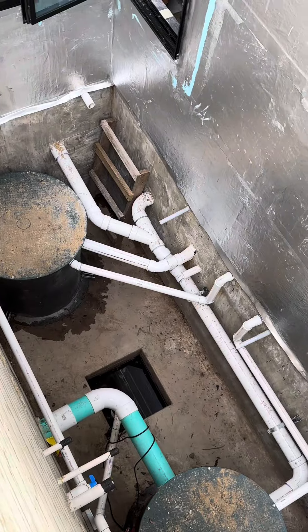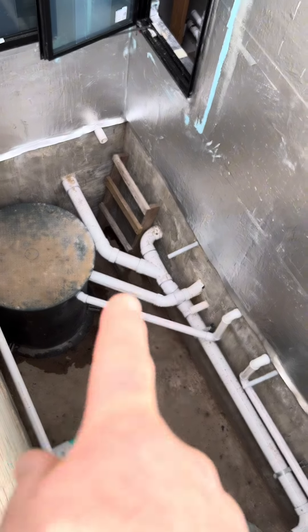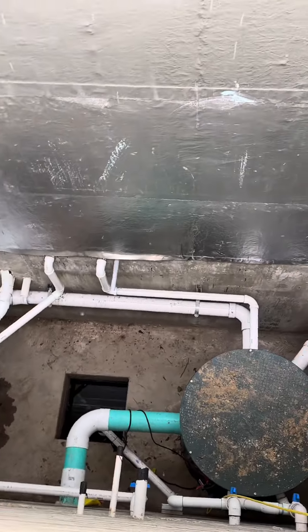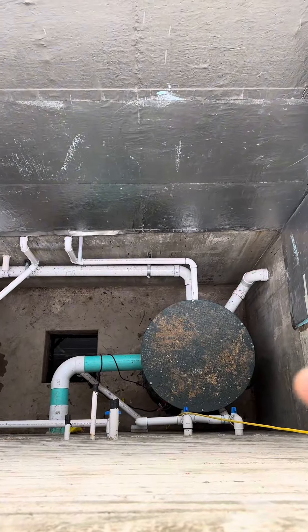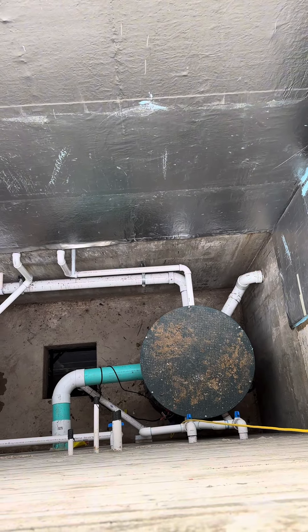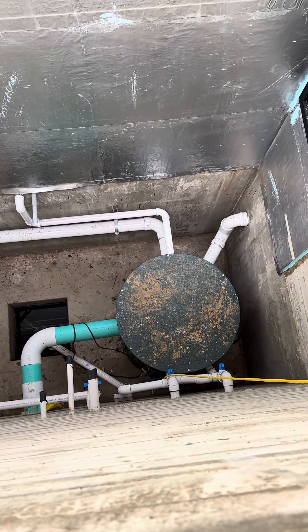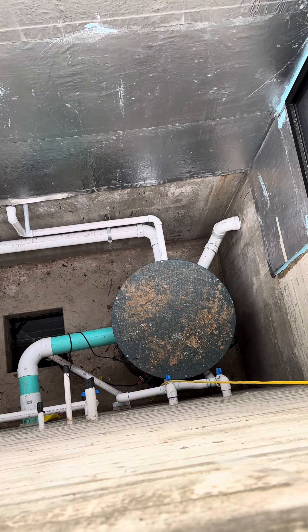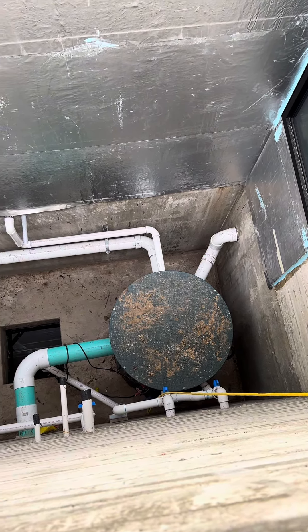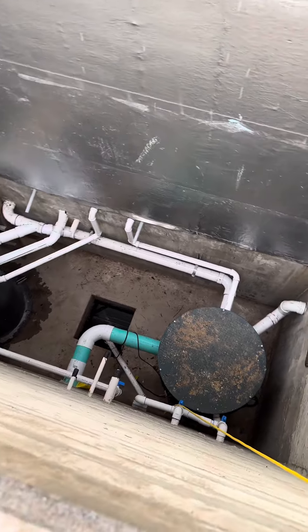See that four-inch piping — actually that might be five-inch, believe it or not, four or five either way — coming out into that Y, coming out of the wall and over to this tank. That, along with that six-inch PVC right there dumping into the tank, is all taking care of rainwater and area drain water from like the patio and stuff like that. The footprint of this house makes it so that there is no place to put the rainwater as it's coming off the house, out of the gutters, and into the scuppers or the wastewater piping roughed in outside the perimeter of the house. It's all dumping into that tank and then being pumped out.